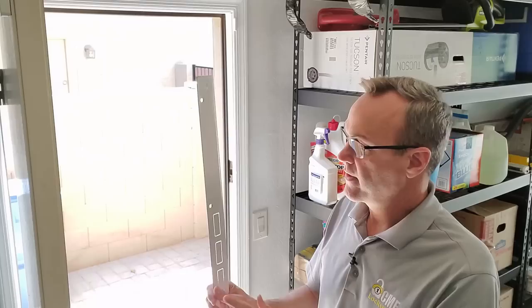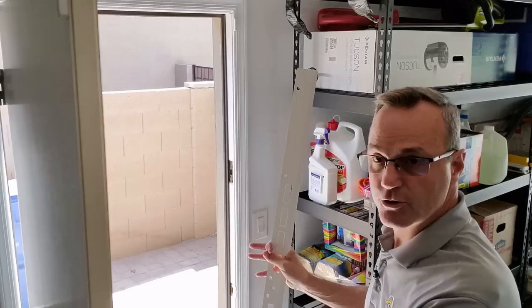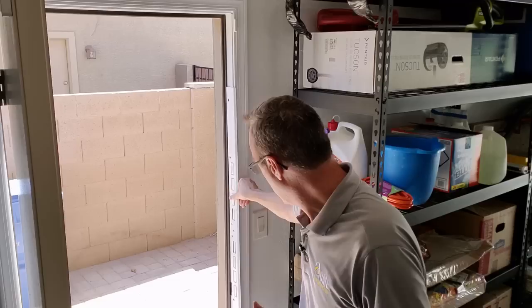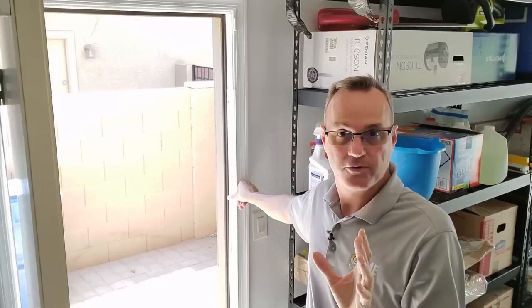The first piece I'm going to install is the very long strike that goes on the frame side of the door. This strike comes complete with knockouts that you remove to make way for the latches so they'll go into the frame. There's no special chiseling involved — it basically installs above everything that's already on the door. You don't even have to take what's there out; just make sure you line up those knockout plates so the latches can go through the strike once it's installed.